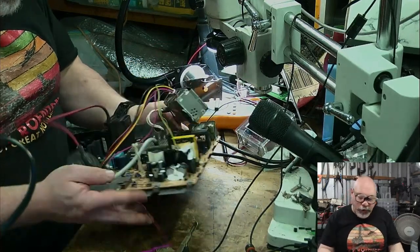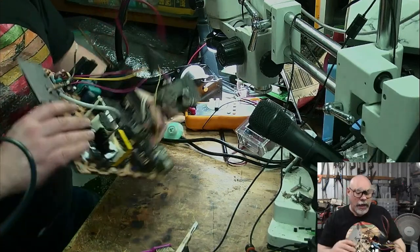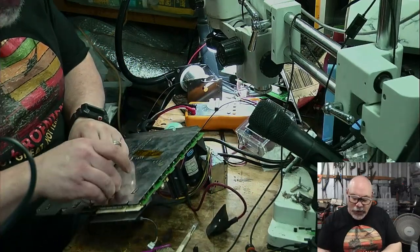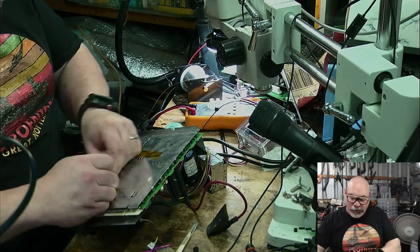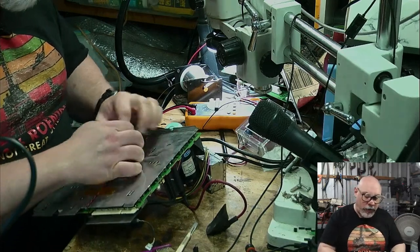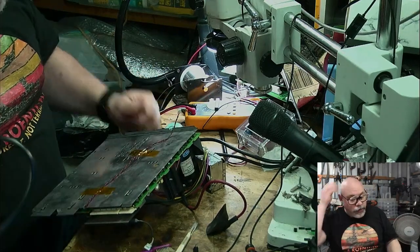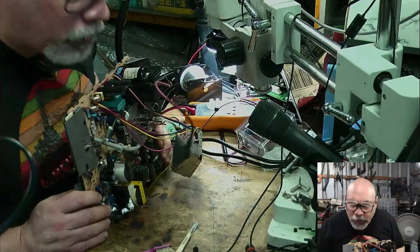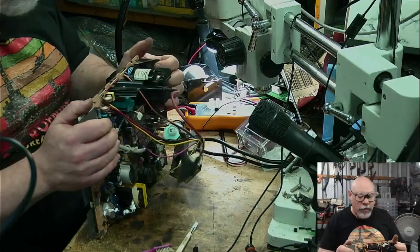Welcome, Michael. Thank you for joining. So I've basically just been fluffing around with some color classics today. The first one, I had an issue with the deflection transistor, and I found a replacement, but it was a slightly different one, and it's not insulated in the same place, so I'm having to try and mount this thing while providing some heat transfer and some insulation. That's right at the beginning of the video. Promising results, but still not quite there yet, so I'll need to get back to that one, but I decided that was too boring to continue with.